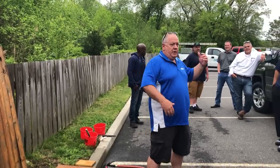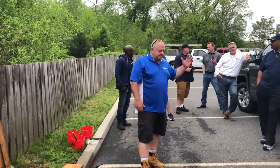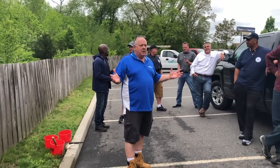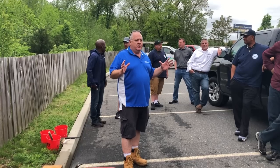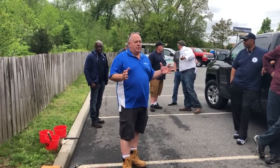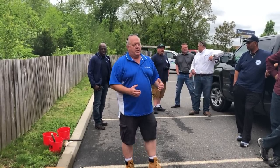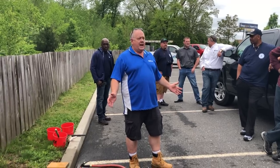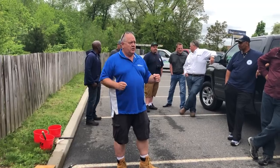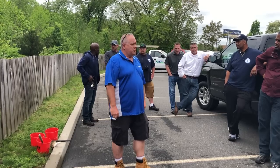We'll do a job. So I went up to Lakewood or somewhere further up north in Jersey. We did the whole thing, and it was all dwell time. We had to wait about 45 minutes. He didn't know what was on it, and it's all just the dwell time. The difference between 30 minutes and 45 minutes can make a big difference. If I wait 15 minutes and can rinse it off in an hour, versus wait 30 minutes and take 2 hours and struggle, it just makes sense. So sometimes you just have to weigh those dwell times.